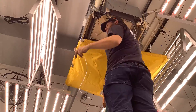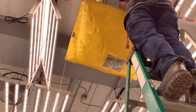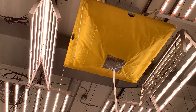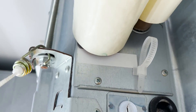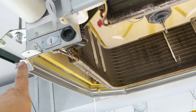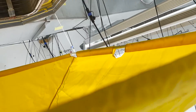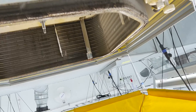This is the Subco ZCA24 — I only use these for the cassette. They say you can use it for a wall unit, but I prefer to just use the bag style. This thing is perfect for this job. The easiest way to get this hung is on these brackets. If it's mounted flush with the ceiling, then where that styrofoam was hanging will work — that's just a bigger hole, a little easier. You gotta tension it to where there's enough of a gap to work, but it's close enough to catch the water.